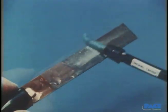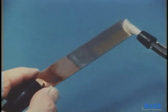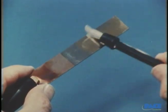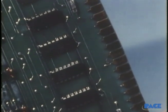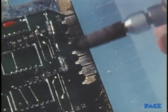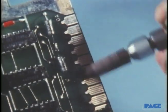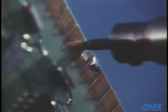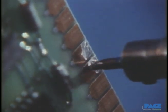Another rinse, and we're ready for the gold, providing high conductivity and lubricity. Now let's watch this process applied to a printed circuit board. This one is going to need all its connector fingers replated. Repair starts by abrading the surface down to the bare copper. However, if solder has been splashed on the fingers, it must be removed by the proper desoldering technique before the abrading is done.